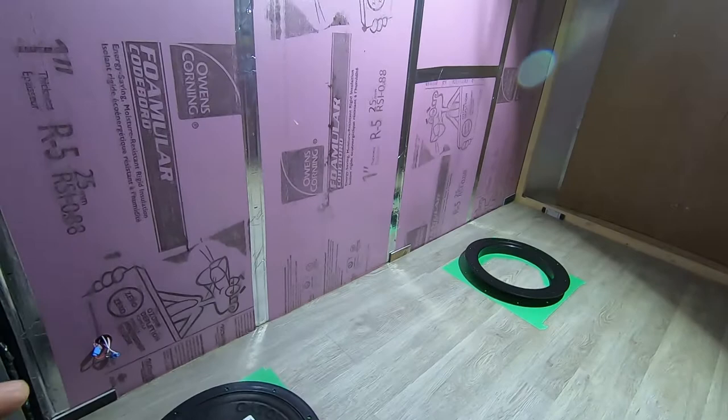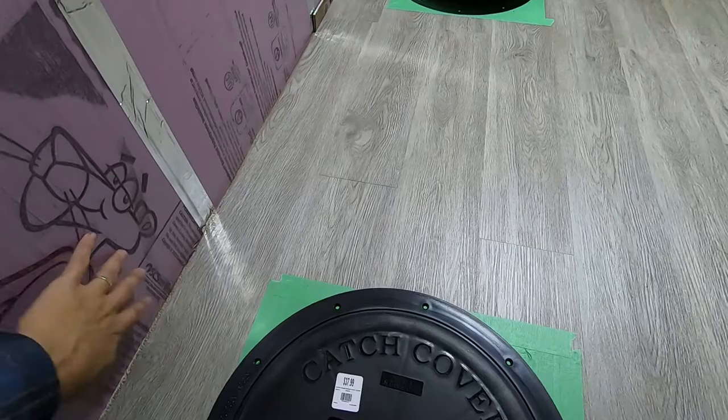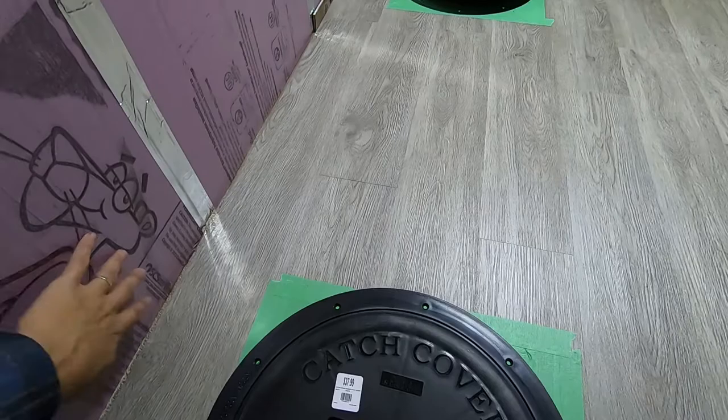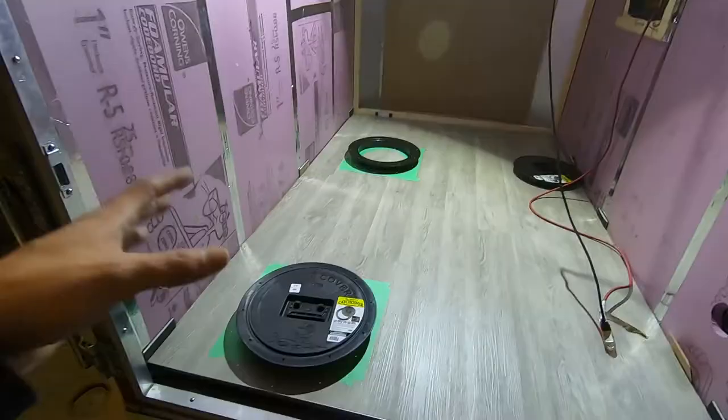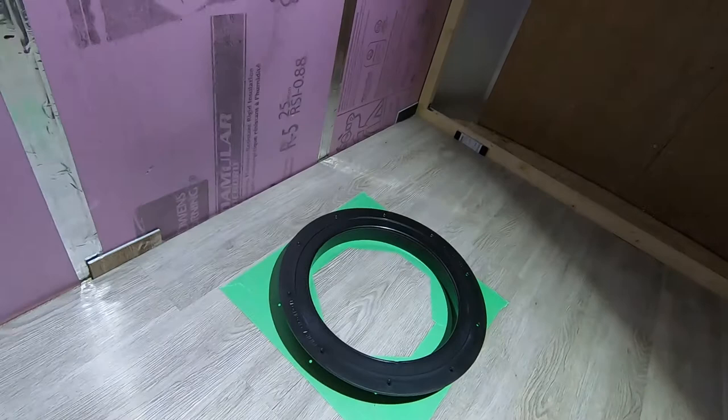Just because of spacing issues — it'd be a little awkward. What I've been doing is basically taking a tape measure from the edge of the wall to the center of the screws and sort of aligning those up nicely, and then I can get those actually very close to the same spacing. Then I will be tracing the outside lip of the flange and using that line to cut with my jigsaw.